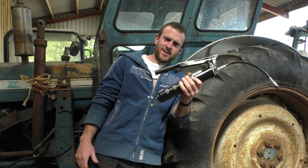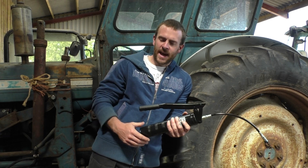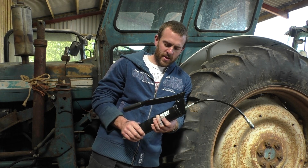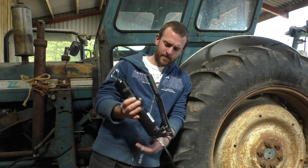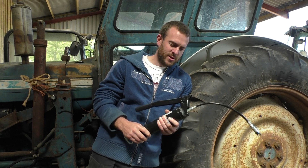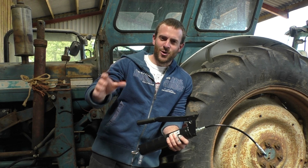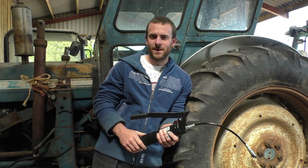Well, that's it — that's how easy it is to load up a grease gun. The next time you come to do this it's even easier, because you've got grease through the system. You just put the cartridge in, plug it back up, and it'll work every time. The first time is the hardest when it comes to loading up a grease gun. For this JCB grease gun, loaded it up easy, tested it out, grease is coming out perfect. So would I recommend this grease gun? Yeah, I would — value at mid-range is very good. I've heard a lot of good stuff about the JCB grease as well, so we're going to test this grease on all the machinery this summer, but so far it's a thumbs up from me. Thanks for watching — if you liked this video and want to watch more of the same kind of content, please subscribe to my YouTube channel. I try my best to put a new video up every week. Thanks for watching.